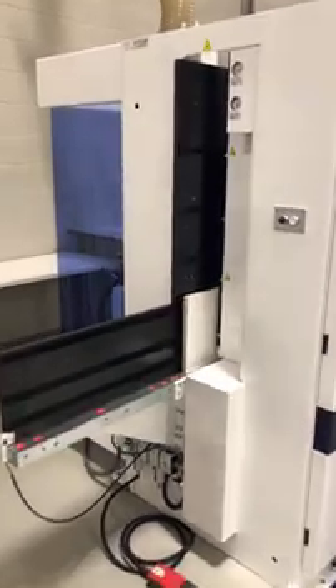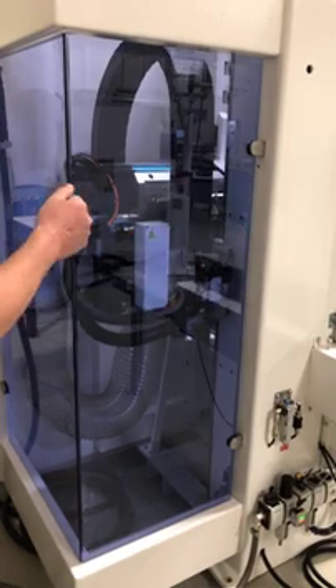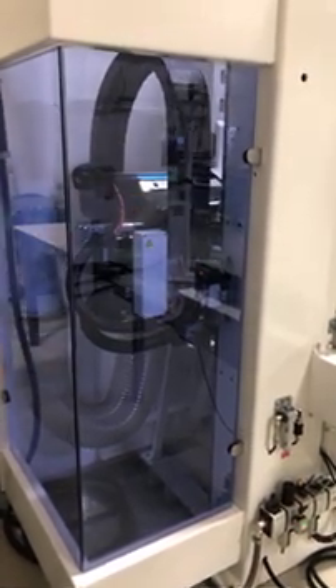What we're going to do now is move the part through on the X axis as my machining head goes up and down the Y axis, and then coming out in Z. So X is the long direction, Y is up and down, Z is in and out — that's a little different than other machines.